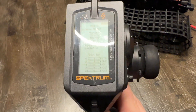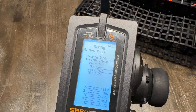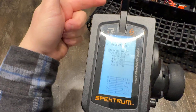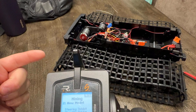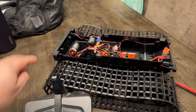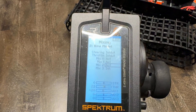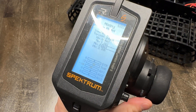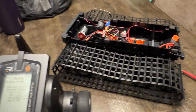Those are the three mixes you need. Even if you plug into different ports, the concept is the same: one throttle mix to the other track so both sides match, one steering mix to rotate one track faster than the other, and a steering mix to the other side so it turns left and right. When you put it all together — hitting throttle and then steering — you get smooth combined control.